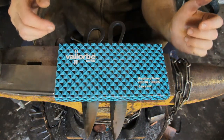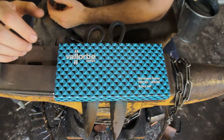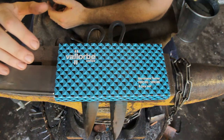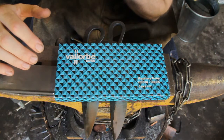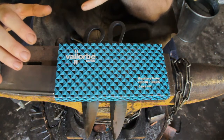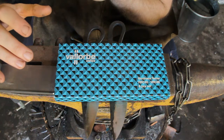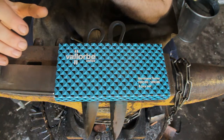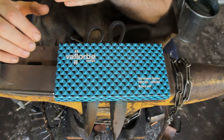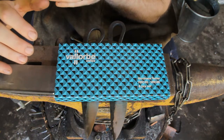Today I'm just going to talk about these hardness files. These measure the Rockwell scale of hardness. It came about around 1906 in Connecticut, maybe. In a bench-mounted system that measures the Rockwell C scale, it basically takes a differential penetration depth in the same spot to find out how much the steel has responded to a very high load versus a very low load, and it gives you a measure of the tensile strength of the steel.